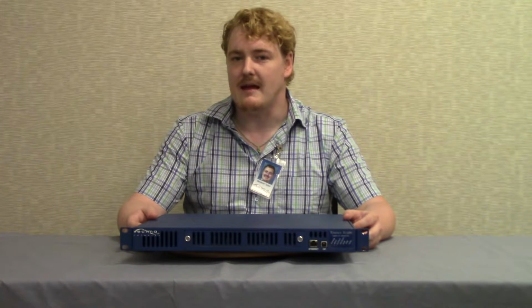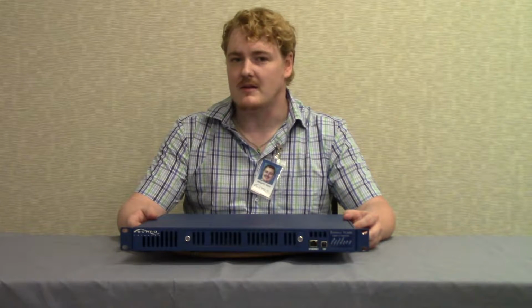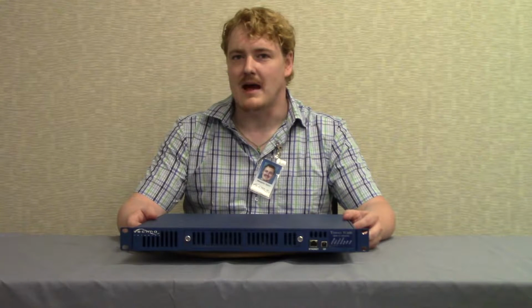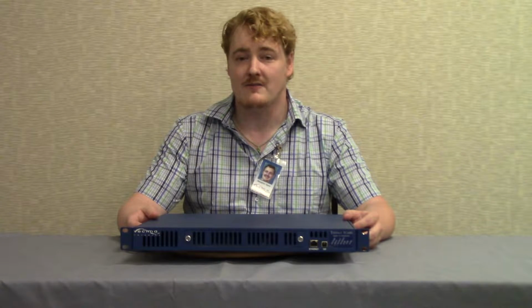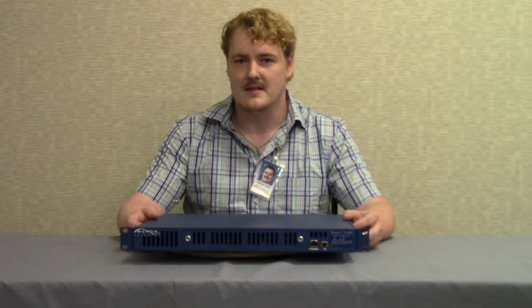The TC600 demodulates and converts MPEG-2 transport streams from up to 8 QAM carriers to RF signals. It can decode and remap up to 46 standard definition MPEG-2 transport streams per chassis, remodulate them to NTSC format analog video channels, and transmit them downstream to analog equipment.